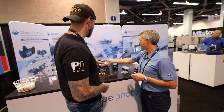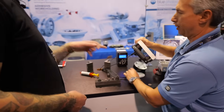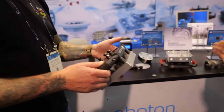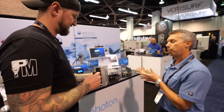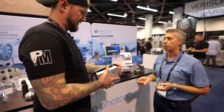Once it's mounted to this, I'm guessing you can take this from machine to machine? Correct, all in the same adhesive. It's got a zero-point system on the back. We have customers that do exactly that — they go from a mill to a grinder over to the EDM. And what's more, you can take that back into the CMM room, do your checks, come back out, and you're not getting the distortion that you could normally get — not at all — with high value parts.